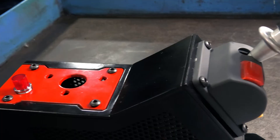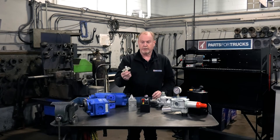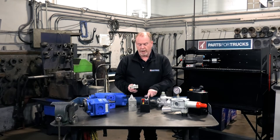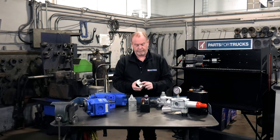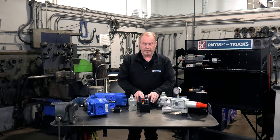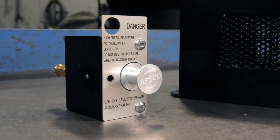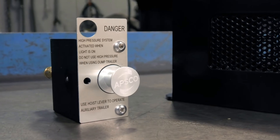You can configure this system many ways. We keep this top plate open so that it allows us to use a valve that can be mounted in there — for the dual pressure case we're talking about today. Your dual pressure system is actuated by the push-pull, which goes to your cylinder and allows for the higher pressure. When it's no longer in use it takes the lower pressure setting back, so there's still safety there — no danger of anybody getting hurt from accidentally using a high pressure system when only the low is needed.